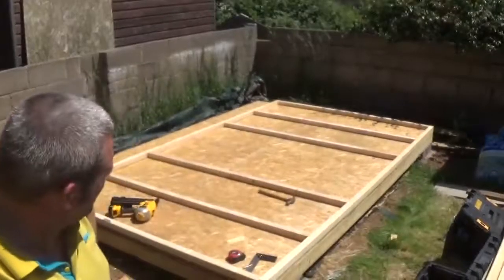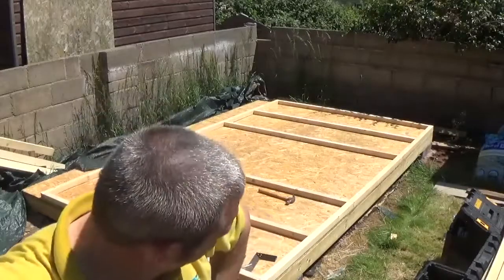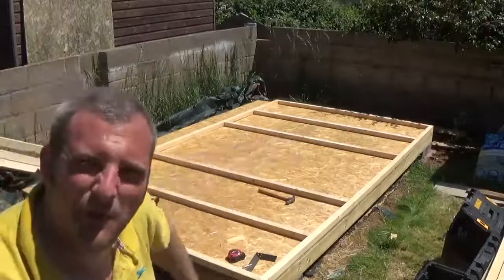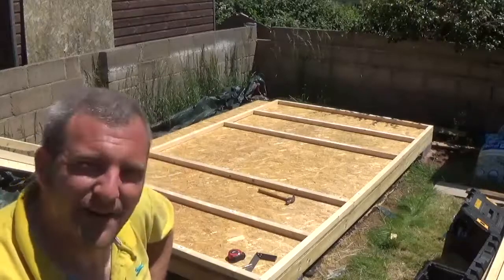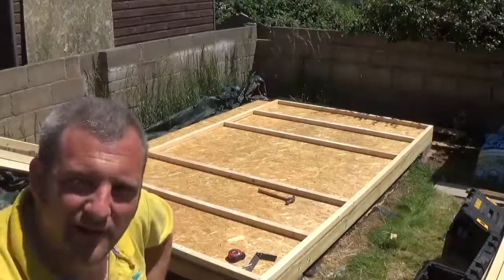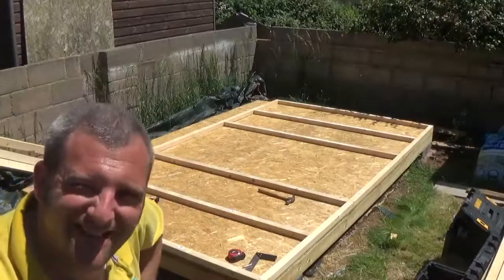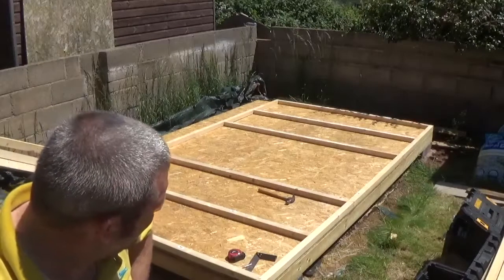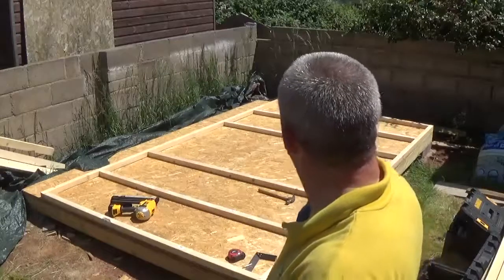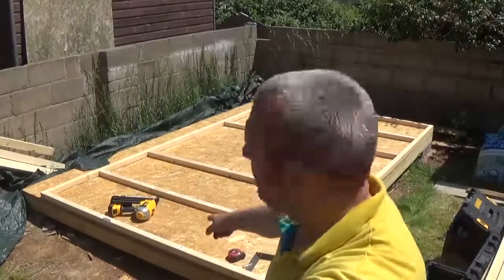There you go — I've done my best with the warped wood. What you're supposed to do is measure corner to corner diagonally to make sure you have an even measurement so you know it's square, but I've had such a hard time doing this on my own. What I decided to do was use a square in all the corners. It's definitely not being done as I'd like it to be if I had an assistant, but I'm determined to make this whole shed on my own. That's the first panel — the rear panel — done.